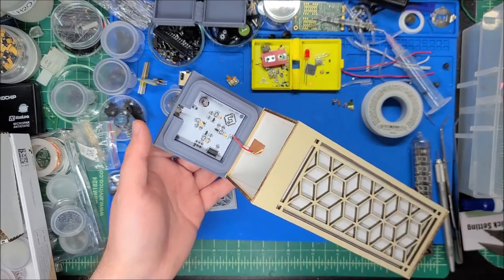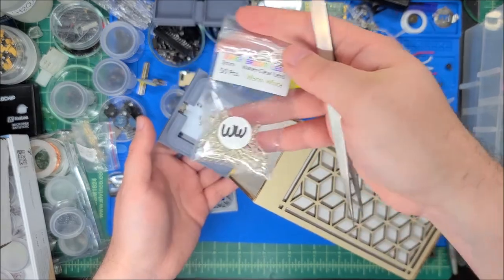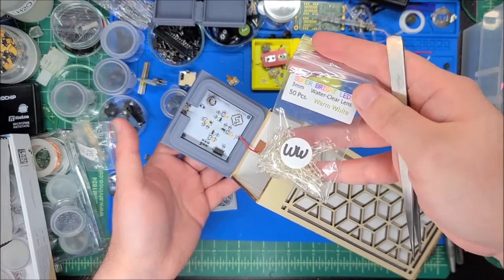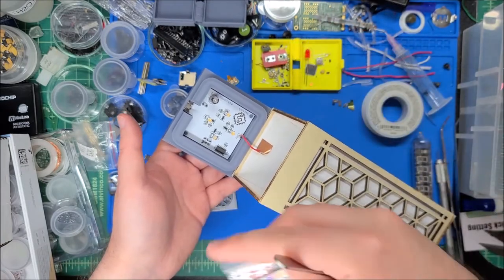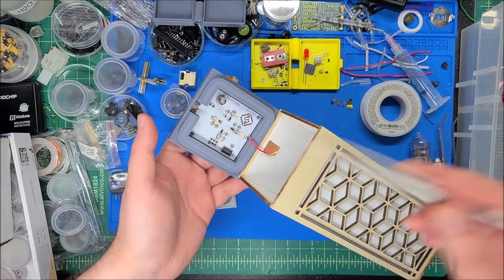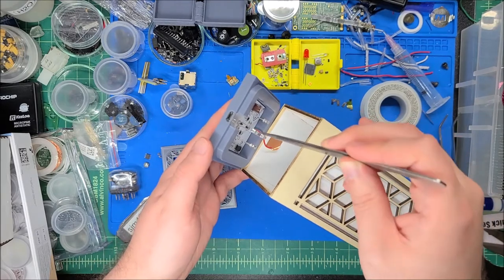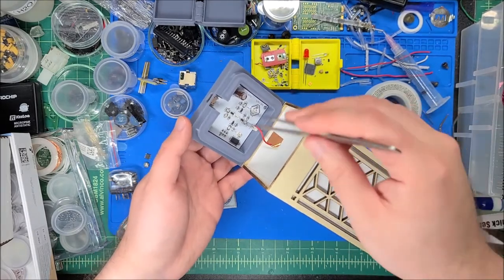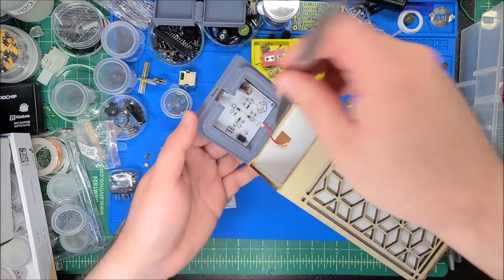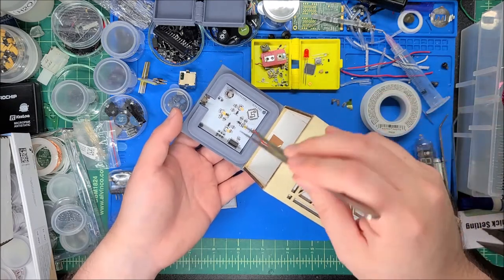I bought a pack of 50 warm white LEDs. I was going to use cold white because I have tons of them, but I'm so glad I went with warm white — it looks a lot more convincing as a candle. They're 3mm LEDs stood off about an inch from the board. I didn't really calculate anything; I just went with what felt right to get the lights starting at the bottom so they'd diffuse as light traveled upward.